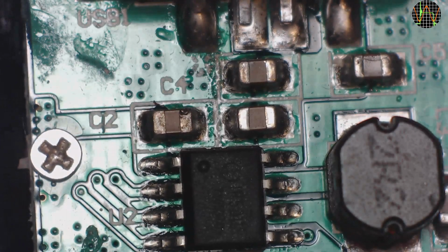The soldering on the two D+ and D- legs looks quite different from the plus 5V and ground. In fact, it looks as if the middle legs of this connector slightly hover over the PCB and never touched its surface properly. The connector itself looks as if it was properly seated flush with the PCB. It could be a one-off, but if the D-legs of this connector brand are generally a bit short, this problem could well be in other power banks of this type.